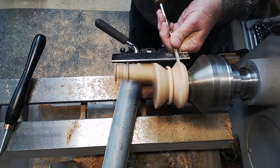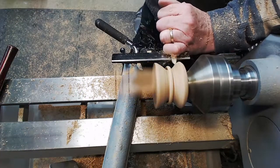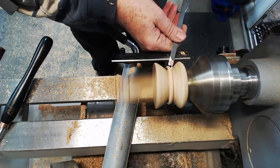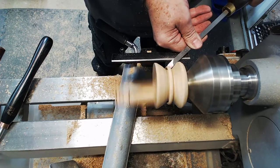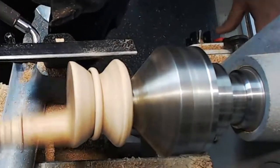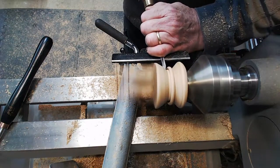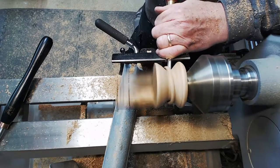I have to go back a couple of times with a small spindle gouge just to trim the sides and make it a bit easier to get in there. Final cut with the tool to just gently tease that ring off without snapping it - just a little final push and there she goes, she's starting to come loose. Now I've just got to go in with a small spindle gouge and dress the profile underneath the ring, just to make the ring a little more prominent and tidy it all up.